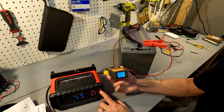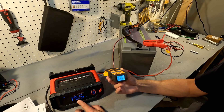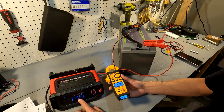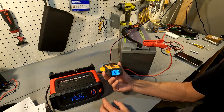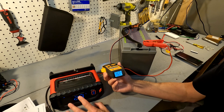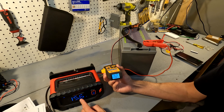Let's press this button and see if we can get it going faster. The voltage is 13.9 and it says 15.5 amps at 14 volts. So it shows that it's charging at 14 volts at 15.6 amps, but my clamp meter only shows 15.15. So it's not charging at 20 amps at all. If you multiply 14 volts by 15.5 you get 217 watts, but this should be able to charge at 280 watts. That's actually kind of disappointing.